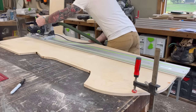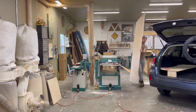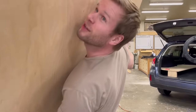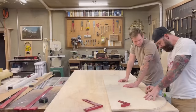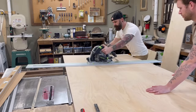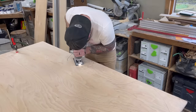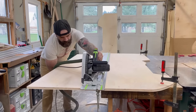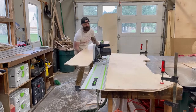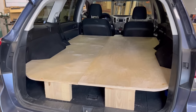Just praying that this was all going to turn out okay. Then I measured the space we had left — that 25-inch rear-end space I had allotted. I thought it was high time Nathan start doing something, so I made him carry the piece of plywood over to the table saw. Then, confident that the other side would be identical, I used my original piece as the new template, traced it onto a new piece of ply, cut it down to length, trimmed it out with the jigsaw — and by the grace of God, the next piece fit in perfect, and our squaring method on that seam seemed to have been accomplished flawlessly.